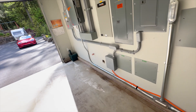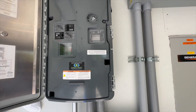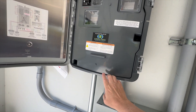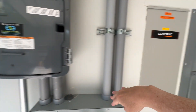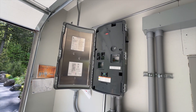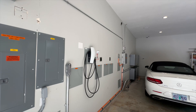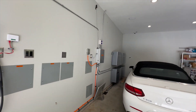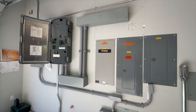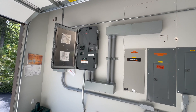The other key component is the smart switch — the Enphase smart switch. The 200 amp service that was coming in and going to the panel I diverted so it now goes through the smart switch, and out of the smart switch comes another 200 amp service going back to the panel. The smart switch is in the middle of that loop. If the power goes out and the smart switch senses that, it clicks a contactor, disconnects the house from the grid, and tells the batteries to make a grid. The batteries create a grid and start outputting power — everything in the house just sees power. It does all that in about 100 milliseconds, so it's relatively hard to detect. It's gone off before and I haven't noticed it.